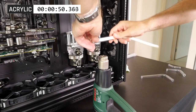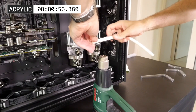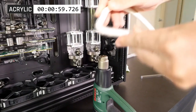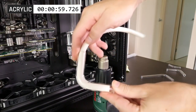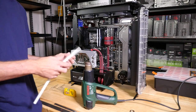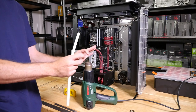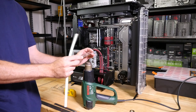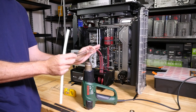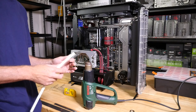Use maximum fan. The distance away from the heat gun is really something you need to judge. If you go too close and you get bubbles, that's it — the tube is wrecked, you've got to start again. It really comes down to experience. If you get bubbles, go a bit further away; if you don't, try to go a bit closer. The more impatient you are, the closer you should go. I'm usually within 50mm of the heat gun, but then as I feel the tube start to soften, I back it off and get further away, because as the tube is softening you know it's getting really hot and close to that point where it's going to start bubbling. You just pull back a bit, but you want it as hot as you can get it.